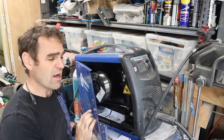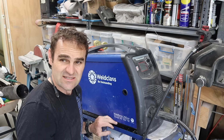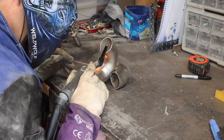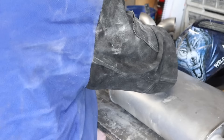I'm going to tack them together now. I've changed over to stainless steel wire on the MIG — you can get stainless steel wire. I'm going to TIG weld these but MIG them together to start with. If you use regular mild steel MIG wire you can go over it with TIG stainless later, but it's better to just do it with stainless from the start. I'm also welding the inside of the donuts now since they only come with the outside welded — that would be quite difficult to do once the whole unit is together.